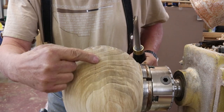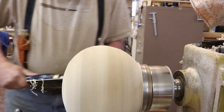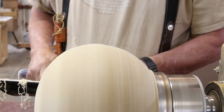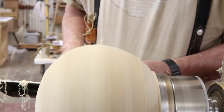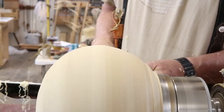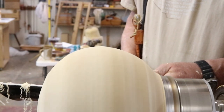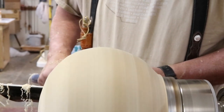I have some badly torn grain right along here and I'm going to work on that. You can see that line on the right side of the hollow form progressing toward the chuck as I make that cut. I like to use this time on a large piece just for practice - I'm making some cuts and scrapes and different approaches with different tools. It's not a finishing cut by any means, but I like to use this opportunity just to practice. Usually it's all practice right up until you make that final cut.